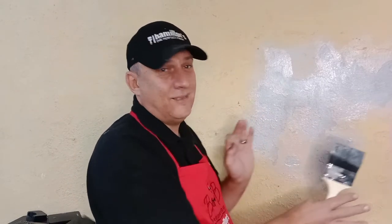We've just applied our second coat and we're going to leave that overnight to dry. If you remember the color, take an old tin in where you buy the paint and show them the color you bought before so you can get exactly what you had. If you can't find a tin, keep one of the scrapings and take it into a paint shop — a good tinter should be able to match the color as close as possible. Regardless of whether it's matched or a standard color, paint from one end of the wall to the other. No touch-ups — those touch-ups are noticeable with a fresh coating compared to the old paint. Two coats damp seal, leave 24 hours between each coat, get your color on corner to corner, no touch-up. Thank you from me, Bernie B, and Hamilton's for that perfect finish.